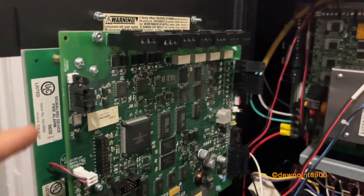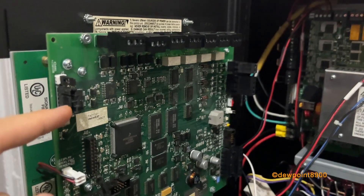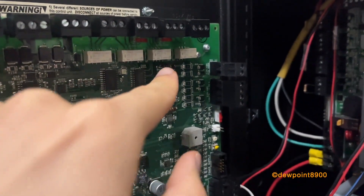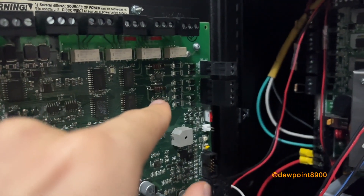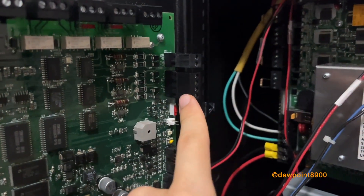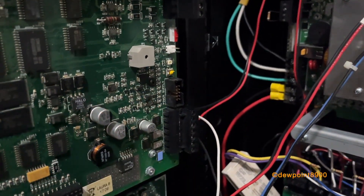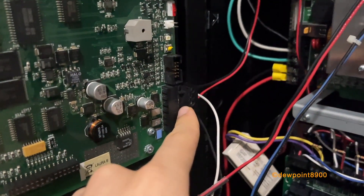On the back of the NCA display is a circuit board. There's a security tamper jumper, a NUP cable connector for connecting to an NCM communications module, and terminal blocks for RS-232 peripherals. There are various relays: alarm, trouble, supervisory, and security. The supervisory and security relays can be converted to alarm relays if desired. There's a terminal block for ACS annunciators, a larger one for terminal mode annunciators, a KS1 key switch jumper, a piezo, a ribbon cable connector for monitoring a power supply like the NPS24A, and 24V DC input and output.